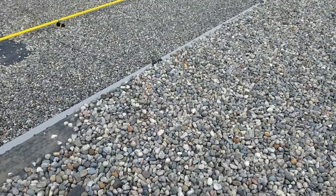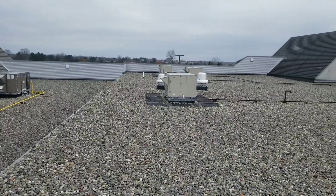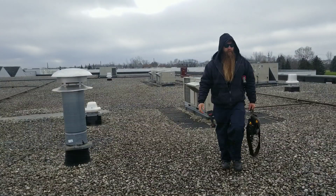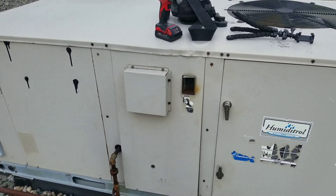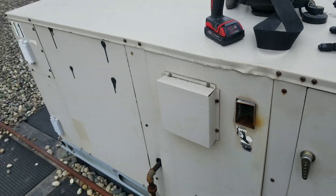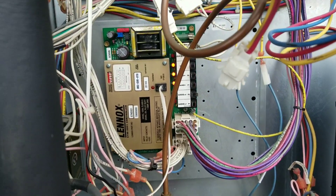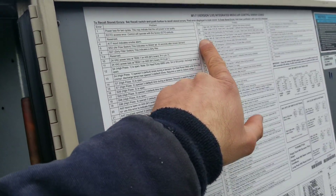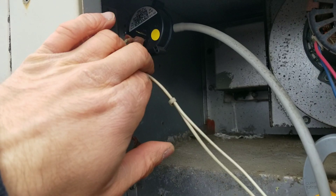Alright, RQ number 11, let's see what we've got going on — inducer's blowing cold air. Popped this open and our energy management board has a two-stage call for heat, code 56 — air proving switch. I'm guessing yep, air proving switch number one is open. Let's check it out.